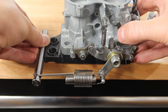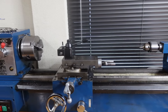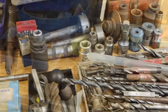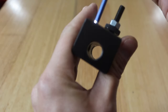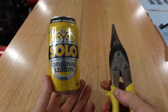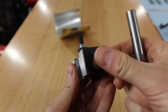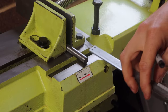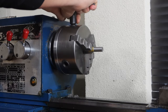One final check to make sure the length is going to be correct. My next roadblock - I'd really hoped to have my mill set up in time for this project, but it wasn't to be. So seeing as we're winging it, and a lathe is really just a horizontal mill, and I happen to have this rather large collection of tooling that I'll talk about in a future video, this might be the perfect project to test some of it out. I've got this boring bar holder which is the perfect size for what I need, however I'd like to avoid marking the surface of the part if possible. The stars have aligned - there should be just enough space to use this can as a shim in the tool holder, and hopefully it will protect the surface of the part from marking. Studies say 60% of the time it works every time. Now let's cut this extra length off. I'm not super keen to part things off in this lathe - being that it's so small it's quite prone to flexing, so it's much easier to just cut it on the bandsaw and then face it once back in the lathe.